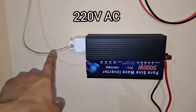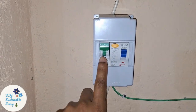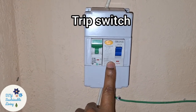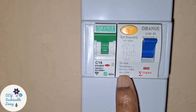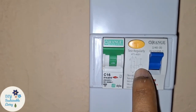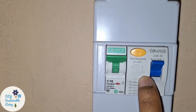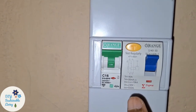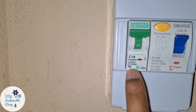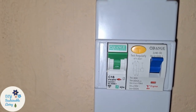From the inverter, the wire goes to a home setup. What I have here is a mains breaker, a circuit breaker, and a trip switch. The trip switch works by monitoring an additional circuit between the two lines — if there is a difference of around 30 milliamps it opens the circuit and the whole thing shuts down, to prevent electric shocks. There is also a 16 amp circuit breaker so that if one of your appliances shorts, it will switch off the system.